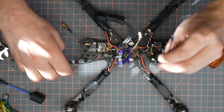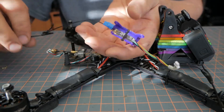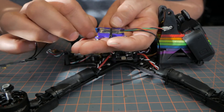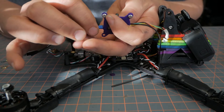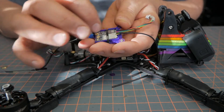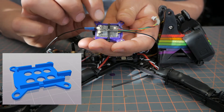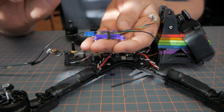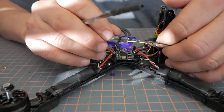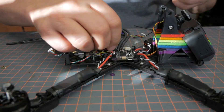There's our full Crossfire Diversity with the two antennas and shrink wrap. With the mount I made a little piece that sticks out so you can shrink wrap the antenna to keep it from moving around, because the only way to make it reach is to run it straight out — you can't loop it up. There's a little fit piece on this printed part that lets you put a shrink wrap on there and that holds it in place. The antennas aren't coming off — the UFL connectors are pretty solid. That's how it mounts on the flight controller.